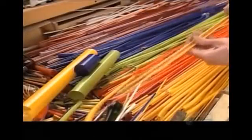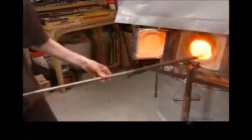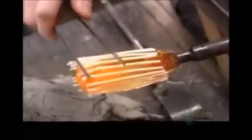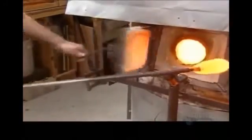He'll use them in various colors to decorate the clear glass cores of the marbles. He gathers a clump of melted clear glass on the rod and shapes it with wet newspaper, which won't stick to hot glass. After shaping the end, he rolls the clump on several preheated colored glass strings. Then it's back in the furnace. He repeats these steps up to three times and rolls the clump on a metal table to even out the surface between each trip to the furnace.